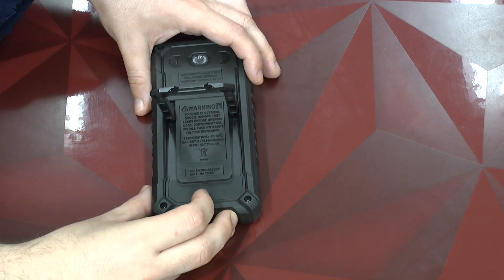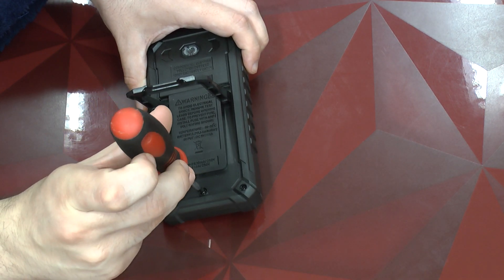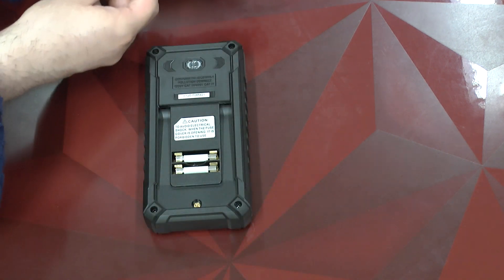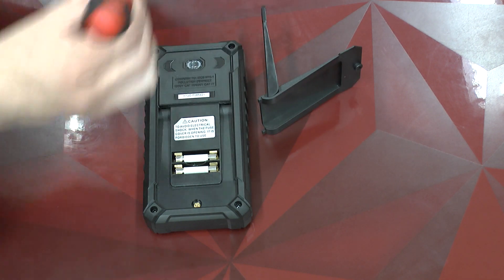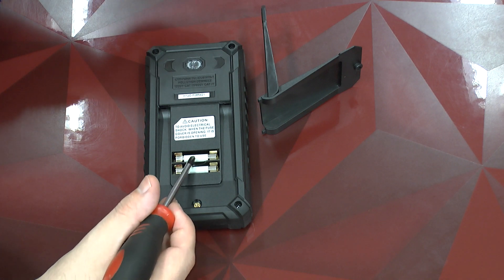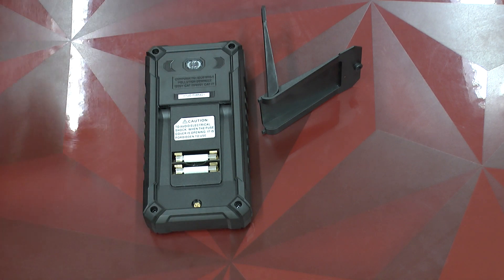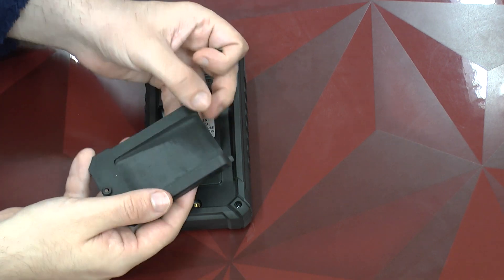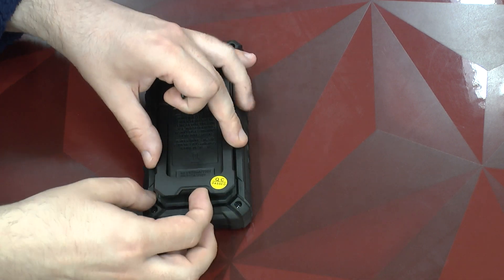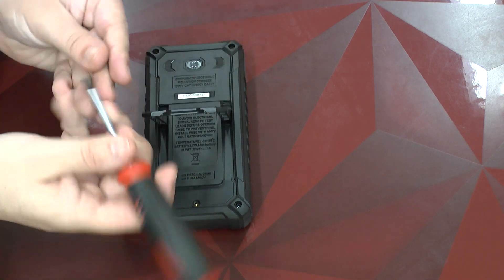Here there is a single screw in what is probably the fuse door, so I'm going to investigate this. This is very nice — this is an assembly which you can probably buy as a spare part, and here we find two fuses. So if somebody blows a fuse it's really really simple to replace it. This is especially important when you are giving this multimeter to cadets, because cadets just love to blow stuff up. And fitting it together, you see here there are these two little claws — you ram it in like so, and then you are ready to go.